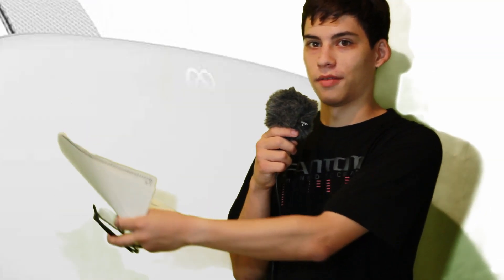The VR has four cameras on the side of it to help it track where it is in the real world. The VR tracks through the luminosity and reflectancy of an object by triangulating a point onto said object, then putting multiple points around the edge of that object to track where it is in the room, making a 3D map of its area. This is known as constellation tracking, and using the cameras on the VR, this is what we're going to exploit.